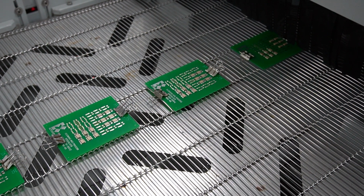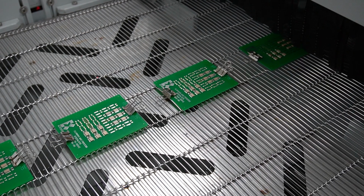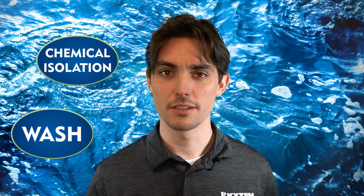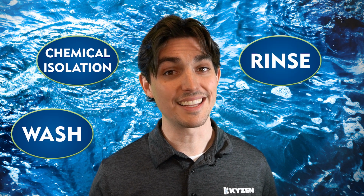You can think about the inline cleaner like a car wash. The boards are placed on a conveyor belt that shuttles them through the cleaner. Now, there are 4 sections that the board is going to see as it makes its way through the cleaner. The first is the wash, the second is the chemical isolation, the third is the rinse, and lastly is the drying section.